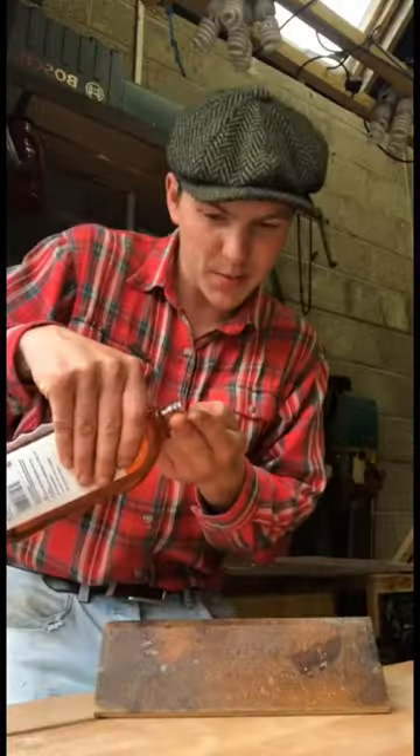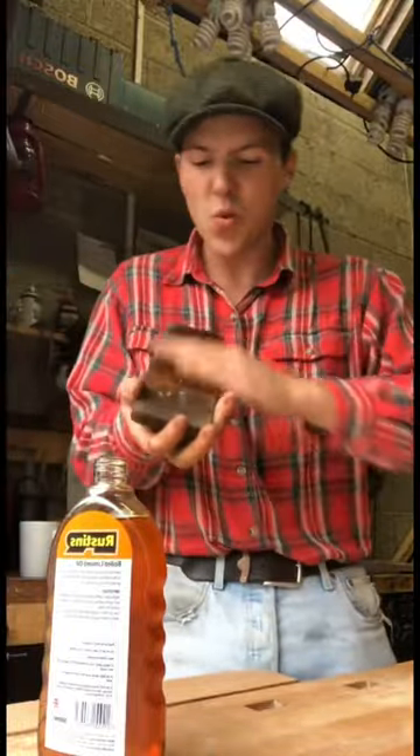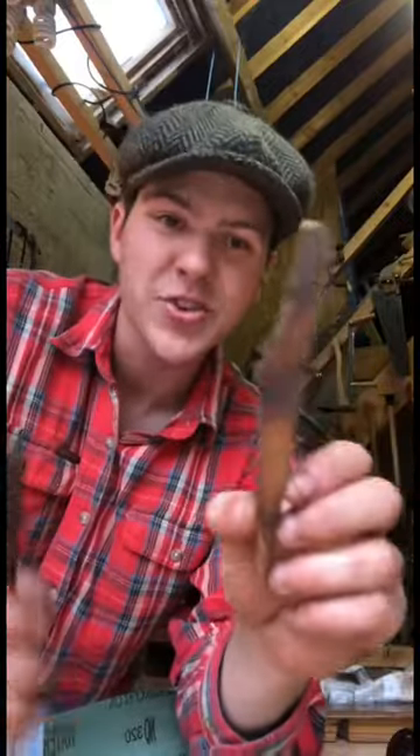Last thing then, just bring it onto the strop to polish it a bit. Now the body of the plane is in fairly good condition, but an old drop of linseed oil wouldn't do it any harm either. You can see here the wedge is banjaxed — there's meant to be a head here — so I swapped it out with one from an older plane that was beyond repair.